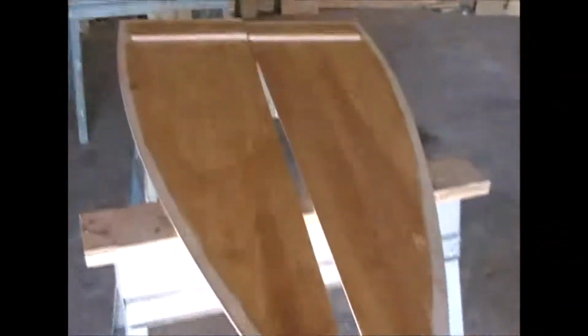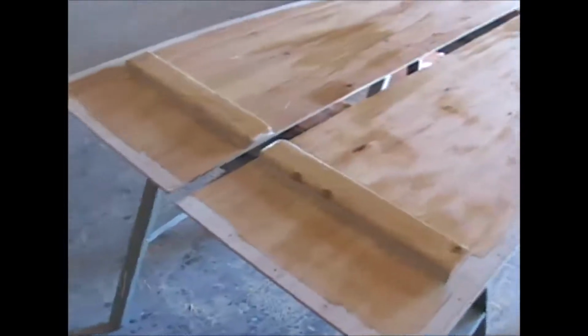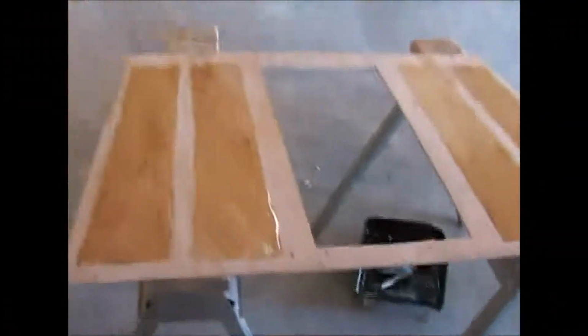Those are deck beams for the aft deck. This is the cabin tops, and I've soaked them with resin, sealed them. I'm going to primer them and paint them while they're like this. I don't like to paint overhead. I got reinforcing pieces there where I might want to sit, and also fasten rigging hardware and brackets for the oars. And I made the deck piece for the back deck.